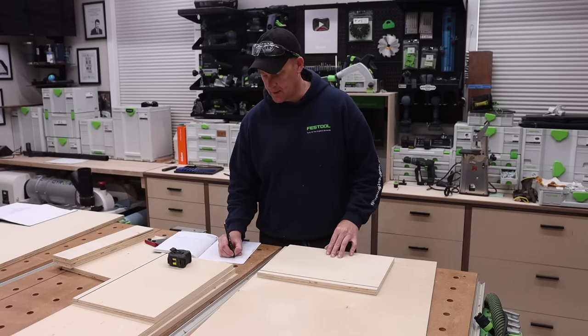With just about every Euro-style hinge, you're going to need a 35mm Forstner bit. The next thing is understanding what the 'tab' is — that's the distance from the edge of the door to the edge of the hole you're drilling. These hinges specifically call for a 5mm tab. This little piece of plastic is another jig from Rockler that comes in really handy; you can also make these out of plywood or MDF. I'm setting my fence location so it's 5mm away from the cutter. You just drop the drill bit down into the hole that's already there, bring your fence right up against it, hold it in place, tighten it down, and then double-check. Once I have my drill bit set, it's time to cut to the desired depth — I typically go right around the 13mm mark. You don't need to do this at a drill press; there are lots of good jigs and you can use a hand drill just as easily.